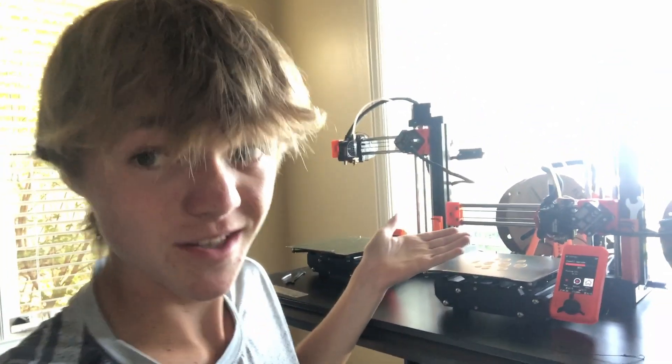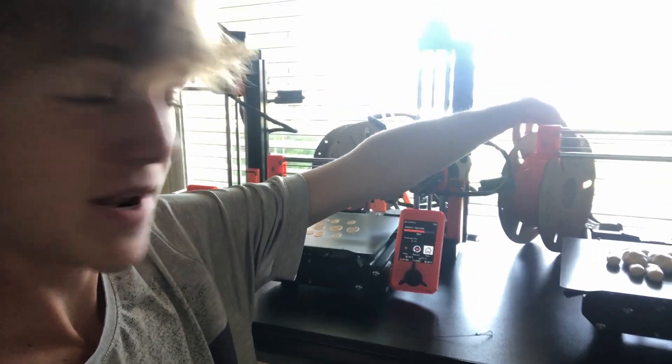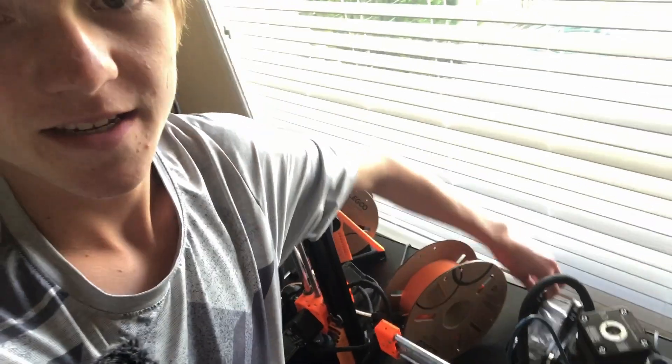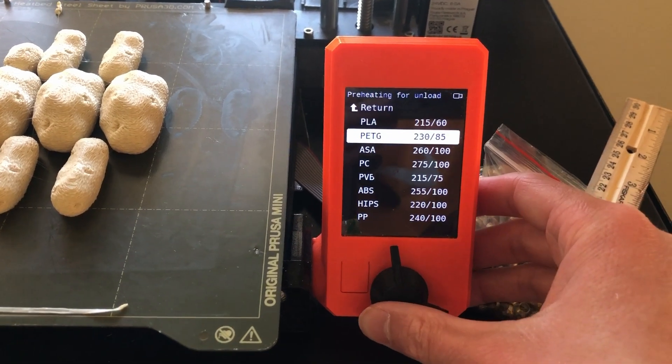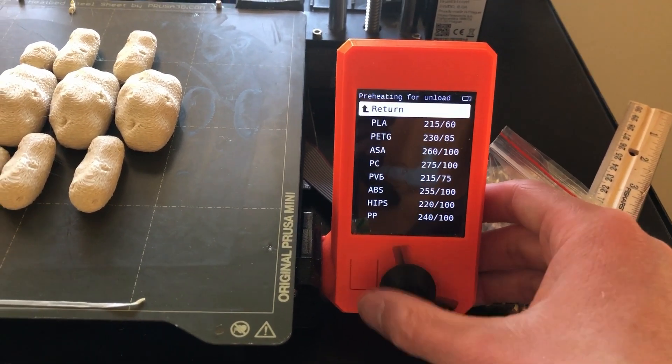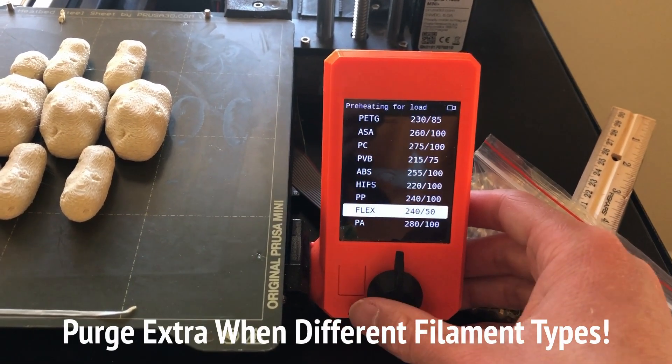While it's a very simple issue, it's definitely one to be aware of. Otherwise, you'll go and try to fix a PTFE tube — like I almost did — and then find out that wasn't the problem in the first place, though you'd probably figure it out when you go to unload it. Basically, just be careful when putting filament on the printer. Make sure it's not twisted, or make sure it's actually properly on. If you're using the default Prusa holders, make sure the spool is actually the right size. That's what happened here — it wasn't the right size and it just fell off.